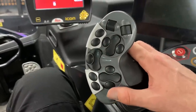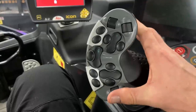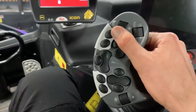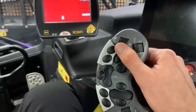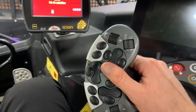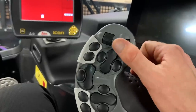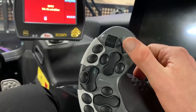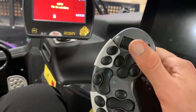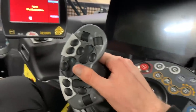There's your pressure — more pressure on the tiller, or up pressure, or click it to put it in float. Up here is your tiller speed, to spin the drum faster or slower depending on what sort of snow you're working with and conditions underneath so you don't clog it. This one up here is your winch tension — if you need more winch tension you roll it to the right and it'll pull harder, and obviously wind it the other direction to let it off. Click it in and that gives you your active boom.